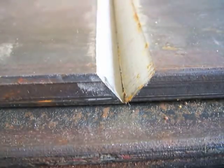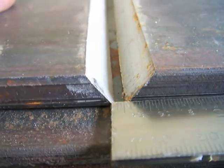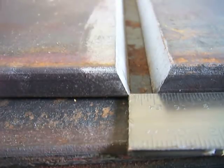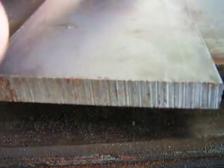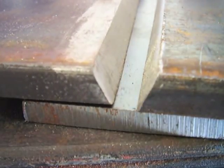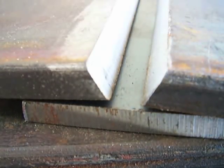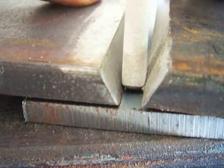It's 7018. Some bevels are 37.5 degrees for some codes, and with that there's usually a 1/8-inch gap. But for structural welding tests, most of the time it's a steeper bevel — 22.5 degrees, or a 45-degree included angle — with a bigger quarter-inch gap and a quarter-inch backing plate. That seems like a big gap, but it needs to be a quarter inch because if it's not big enough it's too hard to get that 1/8-inch rod in there to get the root pass in.